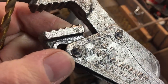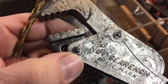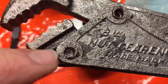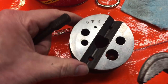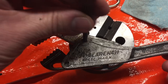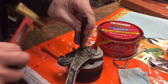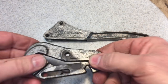Once your holes look like this in the top of your rivets, switch to a 3/16 inch bit and drill these out, going down lightly until the cap comes right off. Now we've drilled through with the 3/16 bit — there's just a little bit remaining. Put the piece over any kind of hole in a piece of wood, or use a punch-pin tool like this one. Put a punch right into that hole and drive the rest of the rivet out the back. You can see how easy that came out.